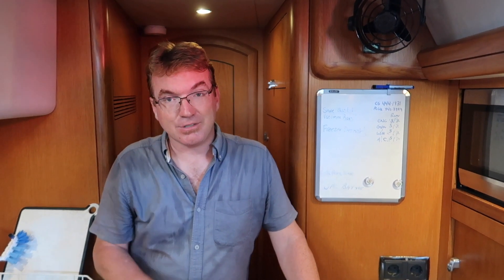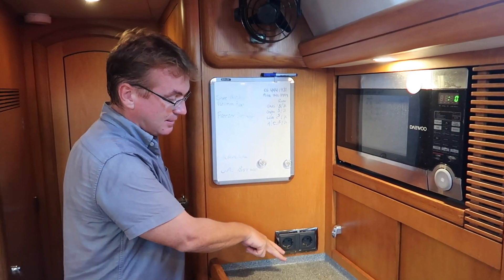If there's no power at the outlet and everything seems switched on, maybe there's a wiring issue, a corrosion issue, or a broken wire. But before you start tearing apart your cabinetry or throw out your microwave, make sure everything is correct along the way. I would go to the breaker first, then make sure the inverter is on. Check the output of the inverter if it's accessible. If there's power coming out of the inverter and all switches are on but still no power at the outlet, go to your AC panel and test the supply side of the breaker. Turn the breaker on — you should have power on that side. If you do, the problem is between that breaker and the outlet, likely in the wiring — maybe a splice or a daisy-chained outlet connection that's gone faulty.